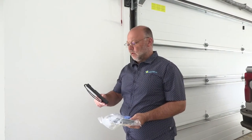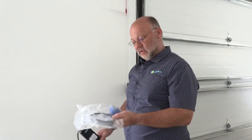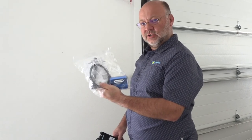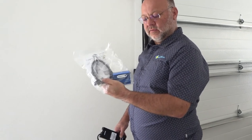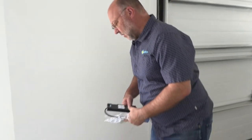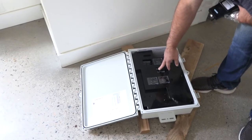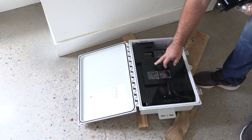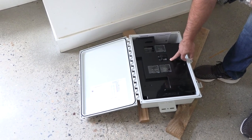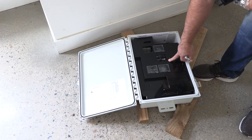The additional equipment we're going to have is a wireless USB communication kit for Enphase and a cell communication kit, which is required for continuous monitoring. For each service panel side, we're going to have a combiner box — like you'd expect, it will contain the Envoy and associated communications equipment. I'll show you about that install in a bit.